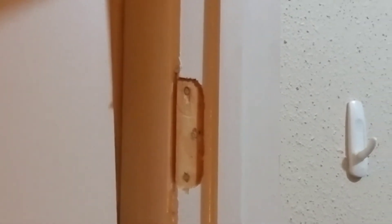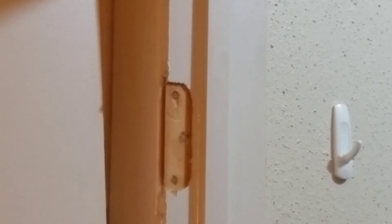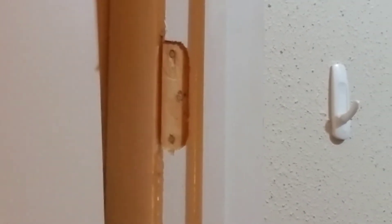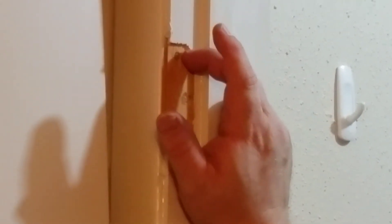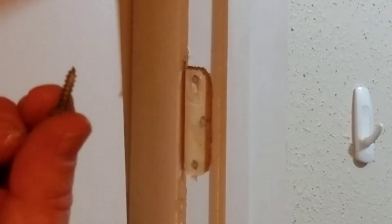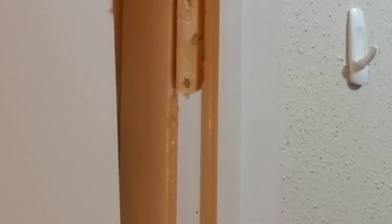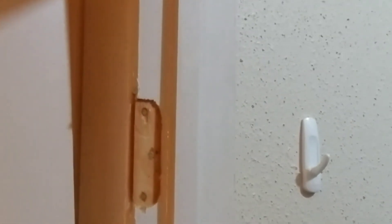We wait 24 hours for the bond of the glue to be full. We mount the hinge in the screw holes that we know are good, line this hinge up, and pre-drill our pilot hole just small enough so that our screws won't split the dowel peg. Then run the screws in and we should be good.